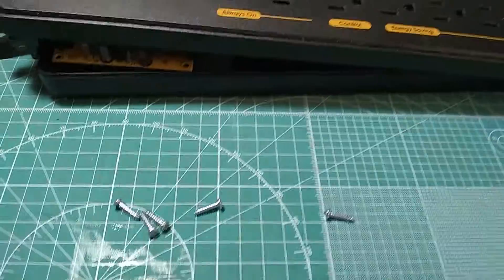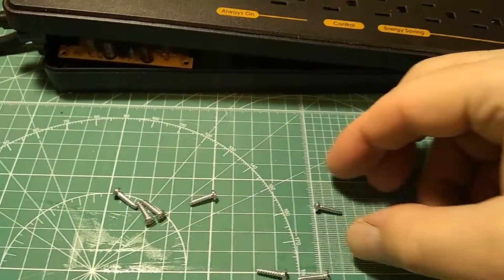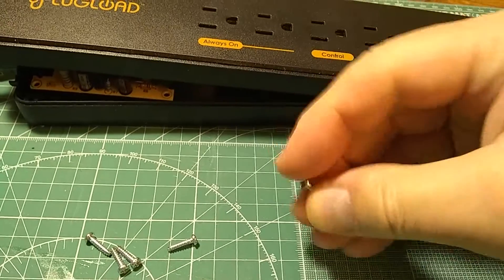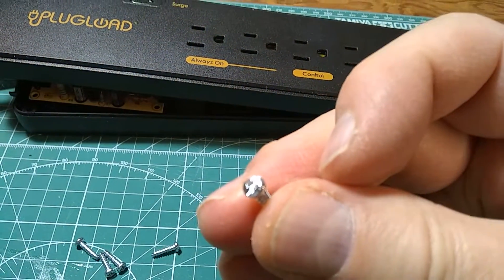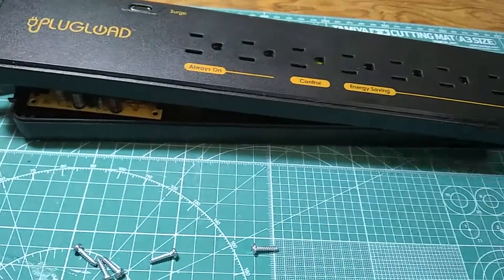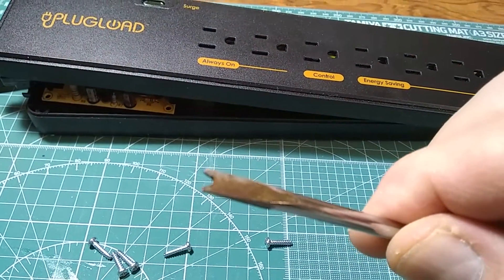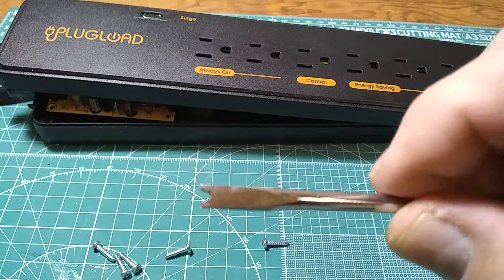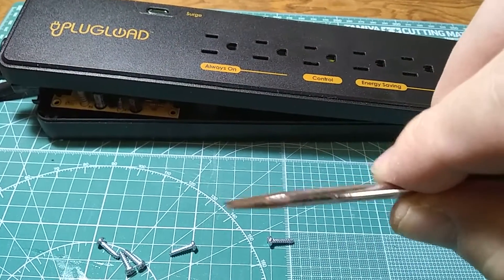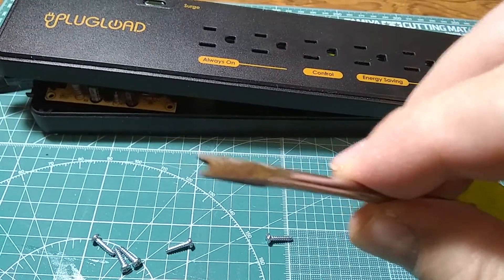What's interesting is that out of the seven screws, four have a one-way screw head, which can be tricky to unscrew. You cannot use a flat-head screwdriver directly, but you can use a flat-head with an incision in the center — the sides of the screwdriver will latch against the head, and you can open it up with that.